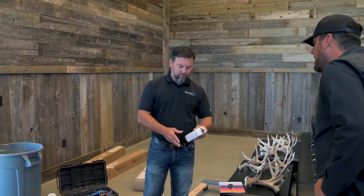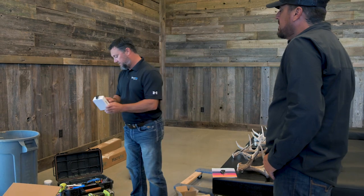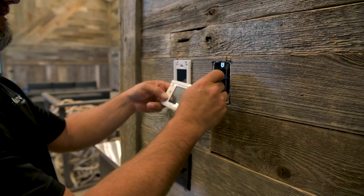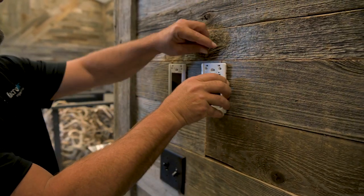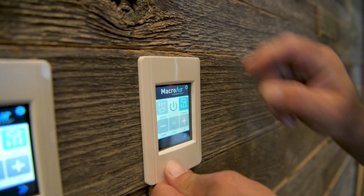So this is the digital remote — we'll look at that later, you'll see the finished product once we finish. There are two ways to mount this: it'll mount on the wall like a regular thermostat, or this can come out and it'll mount into a box, surface mount nice and flush, just similar to your light switch. And that's the way we're doing it here.